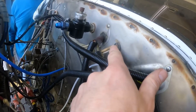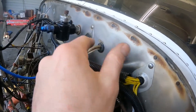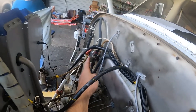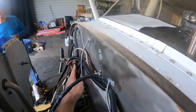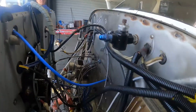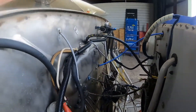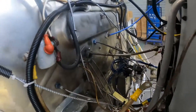Then you have another wire that goes through the amp meter to the bus bar — through the amp shunt. And this right here is your starter solenoid, but on this side of the starter solenoid it's more like a terminal, a binding post where a bunch of stuff that needs 12 volts can land for power. There's going to be some fabrication and rerouting as part of this upgrade, and we've got to figure out where we're going to put the 50-amp breakers, which are a lot bigger than the click-in smaller form factor breakers.